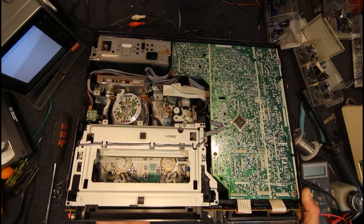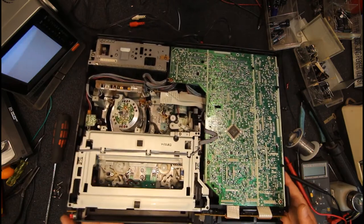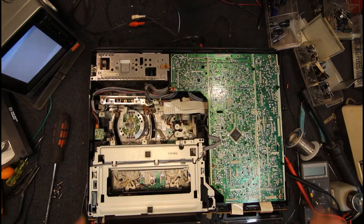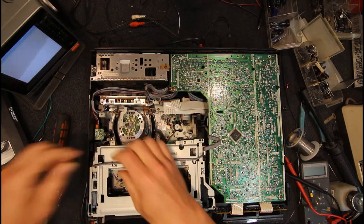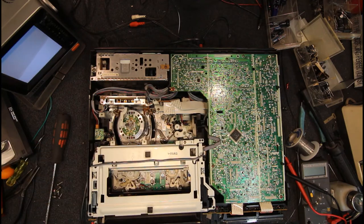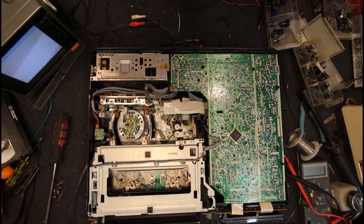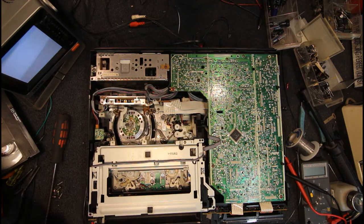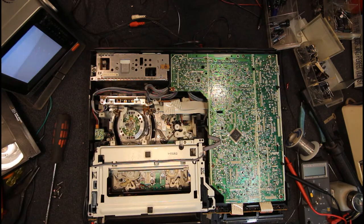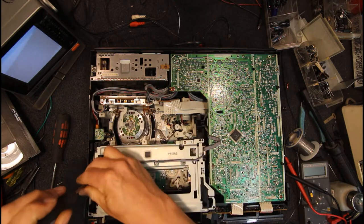Now I'm still turning the wheel, but nothing's happening. We've got these arms partly loaded out, a half-load type arm. So at this stage, I think this is the mode where the mechanism is lined up. Again, in the video online, they tell you you can put this back in the loaded up position, which is quite complex. You've got to fiddle around getting the gears lined up and count so many teeth and stuff, which is not the way I ever learned to do it, because the manual I had just suggested doing it with the deck loaded in.